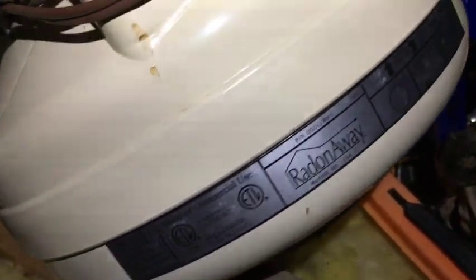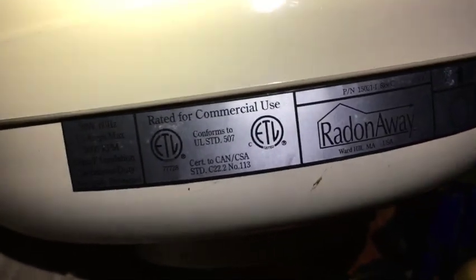I've resolved to put my fan on conventionally — pulling air and radon up from the basement and dispersing it out. We've got a proper plug on and I'm going to test airflow. It's moving air; that's a good reading — it means it's not fighting a bunch of resistance. The high suction fan is installed. Here's the old one — a high flow fan, not known for high suction. Installed in 2002, it's the original fan. The guy came back multiple times, evidenced by the additional suction points downstairs.